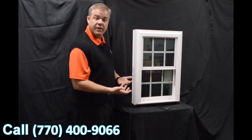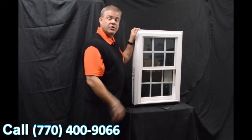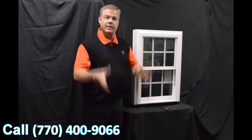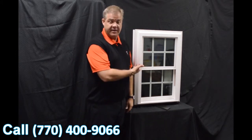One of the next characteristics on the window is the fact that we have an exterior glazing bead. So the harder the wind blows on the outside, the tighter the seal gets on the inside — again, preventing air and water from permeating into the inside of the house.